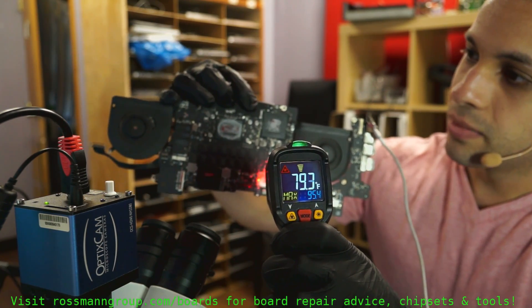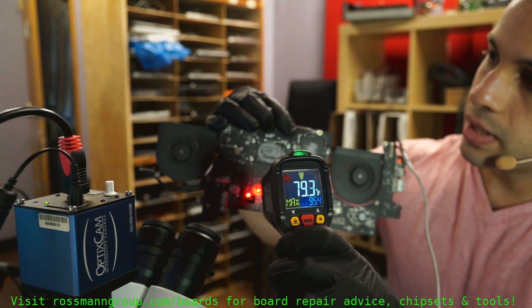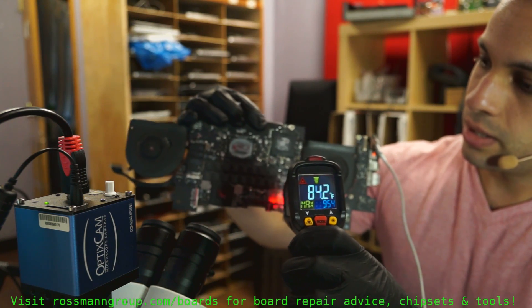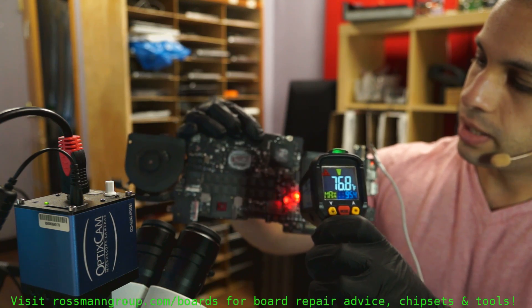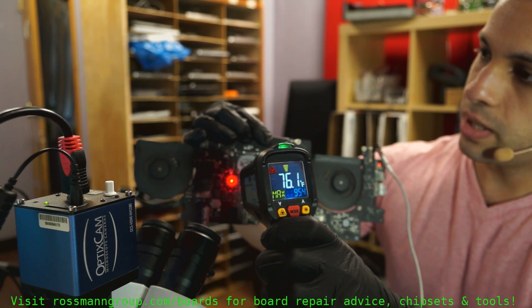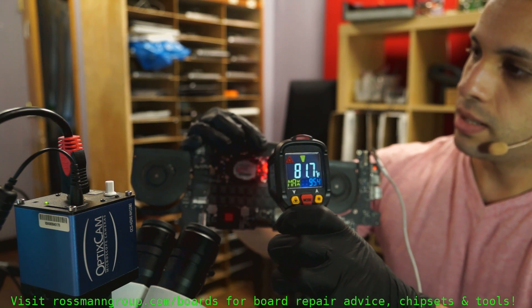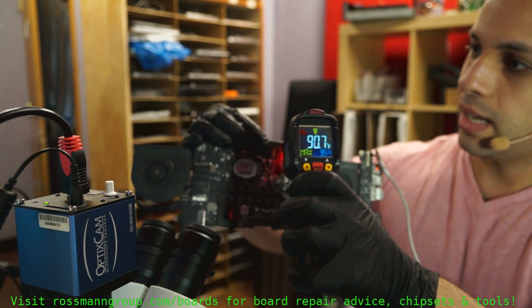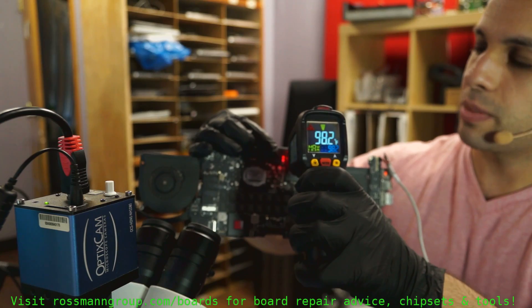Find my short. We're at 79 degrees. That's not it. 77 — colder, colder, colder. 82 — nothing really going on there. We go up this way to 75, 77, 79, 87. Maybe it's my graphics chip — hopefully not. And above the graphics chip it goes up to 98.